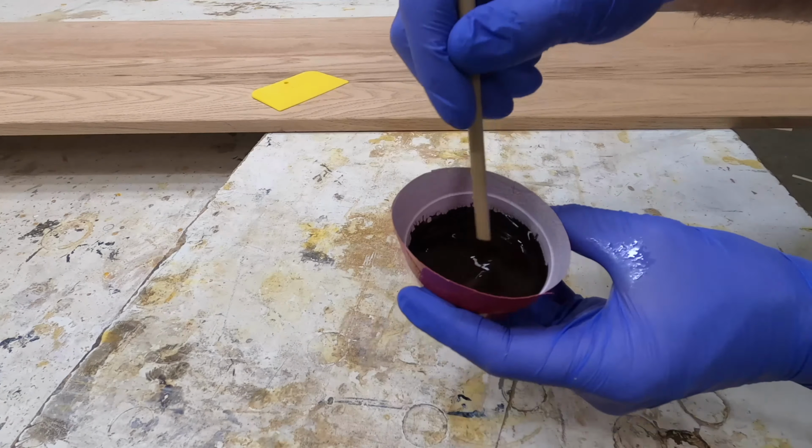So you pour the mixture onto the surface, and then you take this plastic spreader and you just spread it in. One thing about Rubio is that you don't have to worry about leaving any hard lines by the stain. When I first poured that out, I kind of poured it in a snake pattern, and that's not a problem at all because it'll all blend in perfectly. Using this with the plastic spreader is a super satisfying process, and to watch the wood turn the color of the stain, it's just awesome overall.